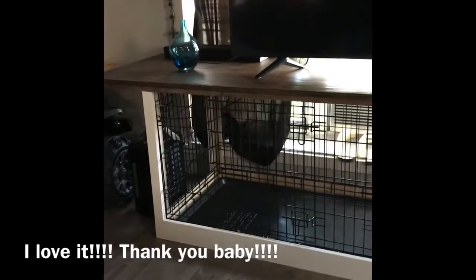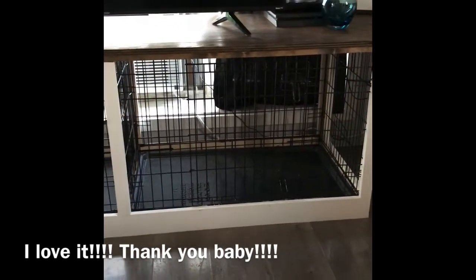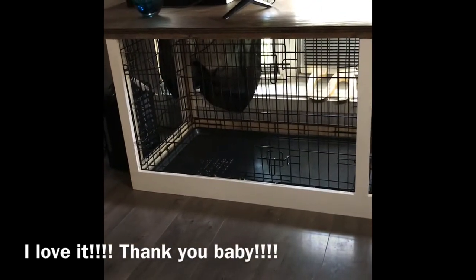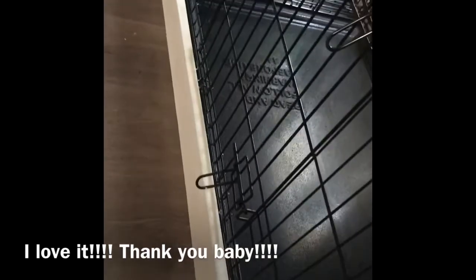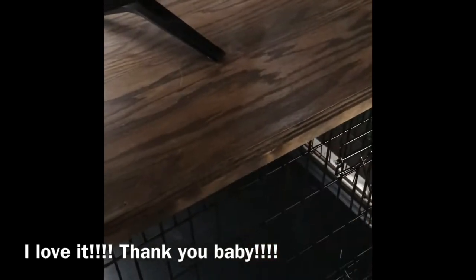Okay, so we used birch for the front railing, and these things here, pretty much the border. And then for the top, I used birch plywood, and for the bottom, I used birch plywood. It was a 4x8 piece. I ripped it in half. Then I cut the bottom one at 6 foot and left the top one at 8 foot, so we would have the overhang on the sides like that. So it would be a bigger table than it was a cage. On the bottom, what's holding the pans is another piece of birch plywood, the other half of that top board. And this little piece here is the drop piece off of these